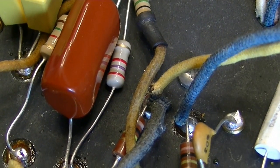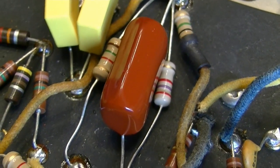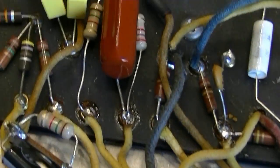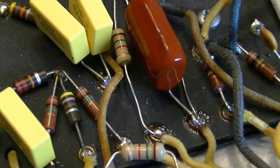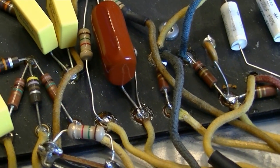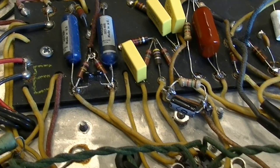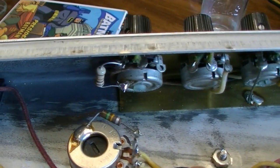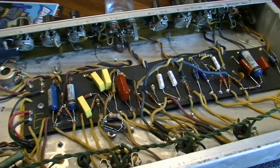This is now a, let's see, what did I put in here? A 2.7K resistor on that first, on one of these stages. It's not the first stage, but it's one of them. This other one here, I've left it with the 1K and added a 0.5 capacitor to one of those stages. And that's more or less it. We may do some more tweaking on this, but essentially that's about it. Also changed that resistor for the fixed mid-range on this channel as well. And I think we're about ready to give this thing a demo.